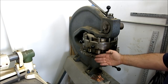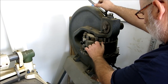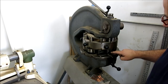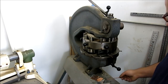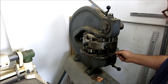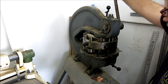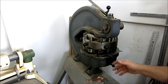For guys that haven't seen one of these — this is the cat's meow in sheet metal punches. You release it and index around to all your punches. This one goes from 5/32 up to 2 inches. You match up the lower die, it has a detent, and then you punch. It's even got a little shear on it to lop stuff off. The punches are very close to the outside edge so you can see what you're doing, and there's enough clearance under the stripper bars so you can see your work. Very useful for making little washers or any sheet metal work.